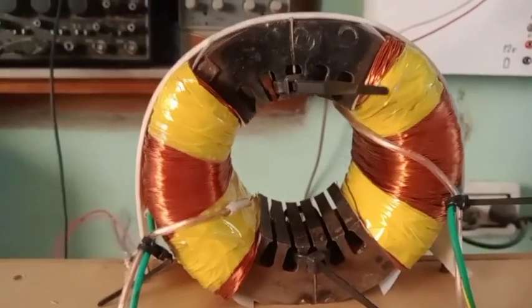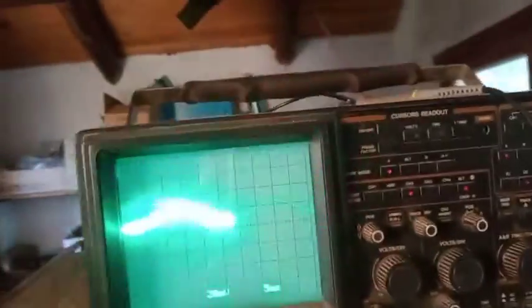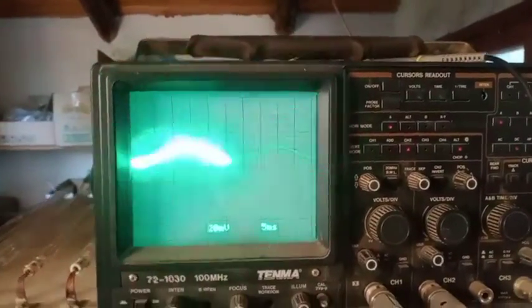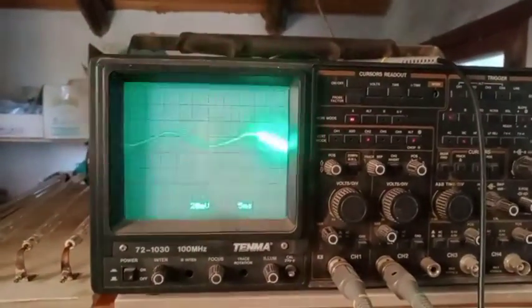And the change is quite notable. I am here at more or less a little above 200 milliamps and the waveform floor falls near almost to zero, which is a good improvement.